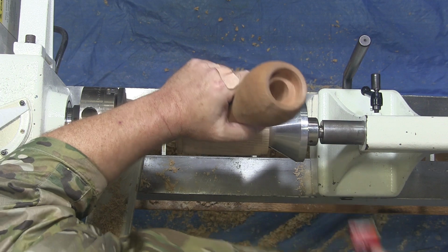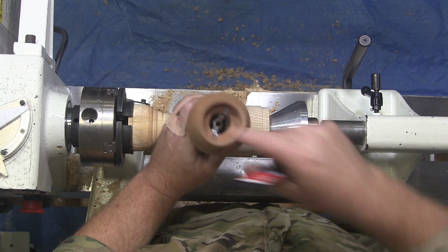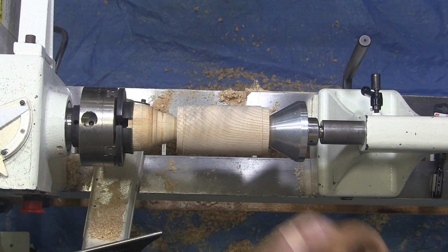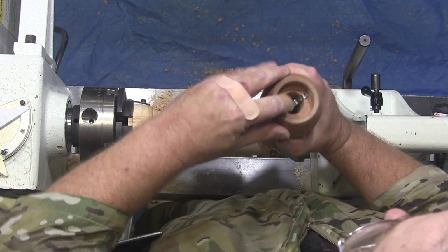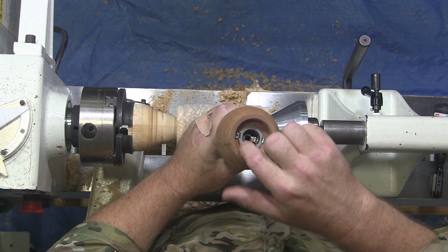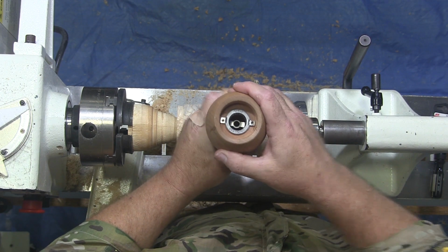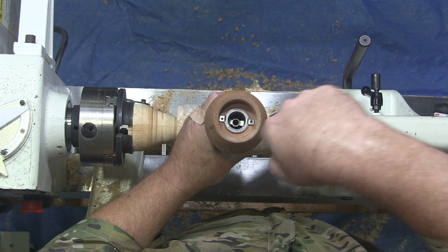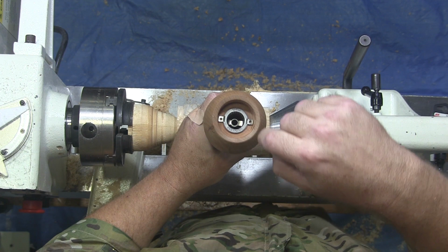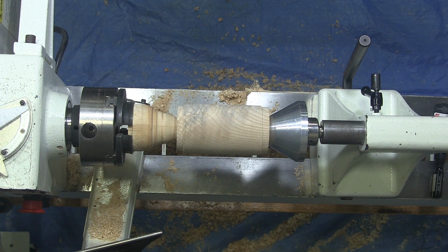I'm going to come in here and I'm going to take this little device here, that housing that's got to go down in, okay? And I'm going to take Doc's center punch. I'm going to take that center punch with this centered, so then I make sure that this is correct. Then I punch it. Then I take it to my drill press, not my hand drill, because I don't trust myself. And I believe it is a 3/32 bit that you drill a pilot hole, okay? Then you're ready to assemble that in.